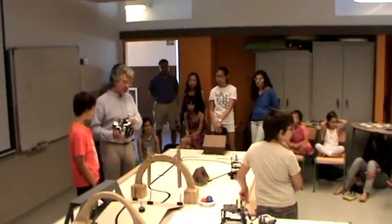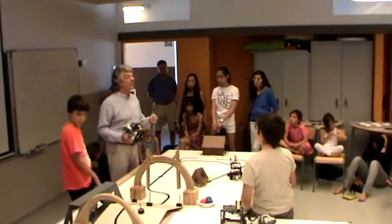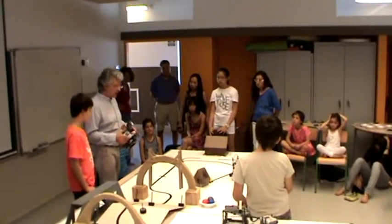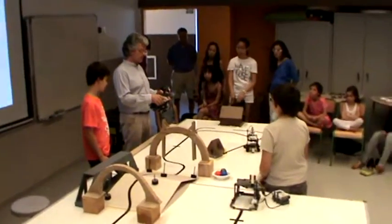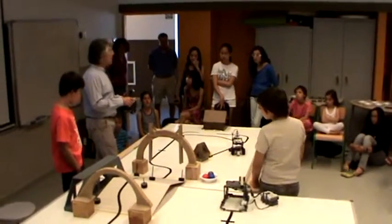The other thing, this one will follow the line with two sensors, and it's very appropriate to climb a ramp. Right, those other robots can't do it because they're slippery, right? So this one just has this mechanism to deliver the ball, and it uses an ultrasonic sensor to detect when it has the ball.